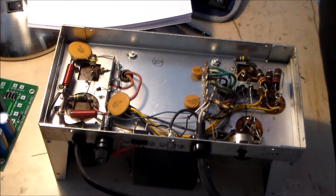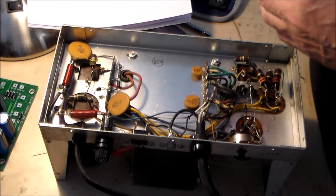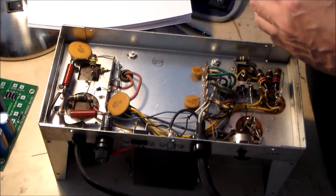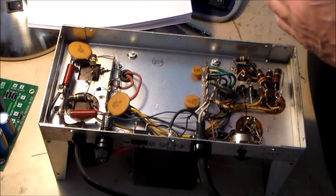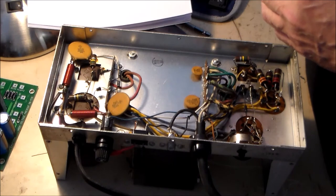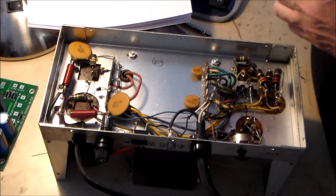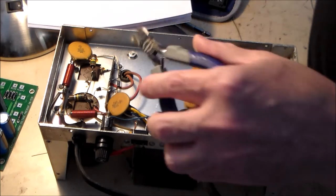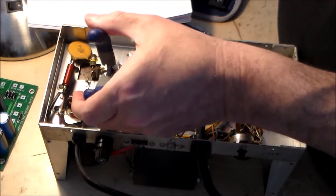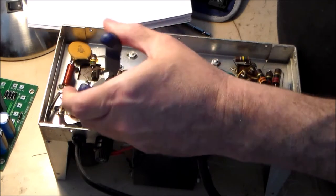So it says at the top of the supply there are four diodes mounted to the terminal strip, two on the strip, two going to the capacitors. Clip out all four diodes, leave the capacitors in place. These parts comprise the 600 volt plate supply. These parts are not used, leave them in for looks. Okay. So, we've got these diodes.